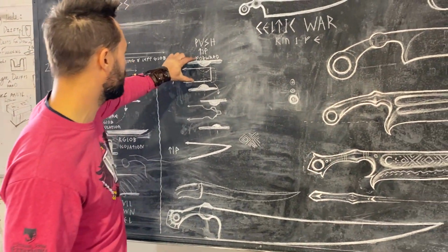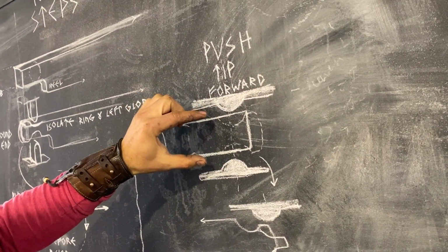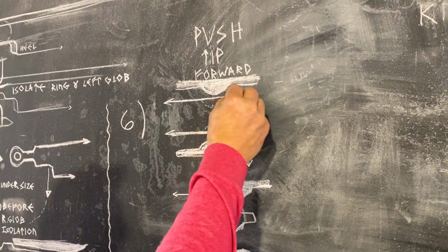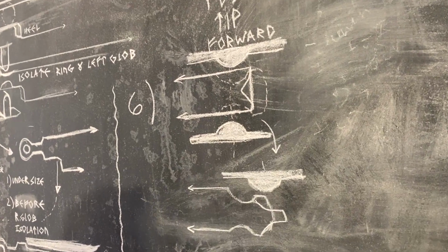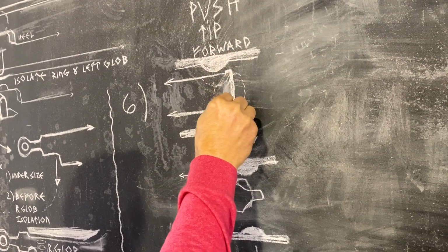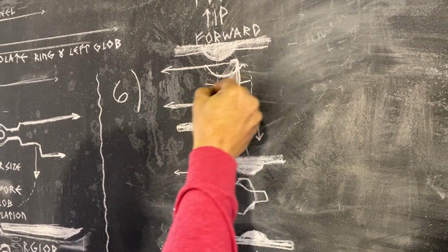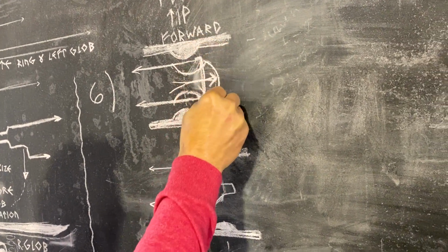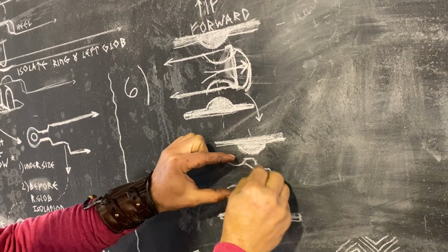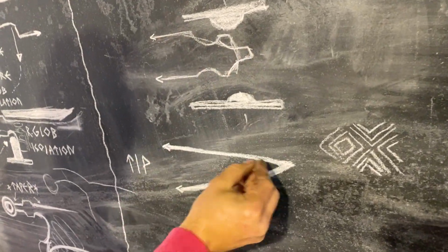Same here. And then over here on the tip, this is sort of standard stuff. Most people are going to know this. A lot of beginners, though, miss this point of forging tips out, and they'll start forging right at the tip. If you move this die to the tip and do that, it gives you this shape, and now you've got a crack right in the middle of your piece. However, if you start just back from the tip, leave just a little square here, a little square there, it's going to push like this, and in the center it causes the metal to move out and creates a mushroom effect on the end of that bar. Then you can squish right on that mushroom and push it right down to there. And from there, it's really easy to hammer that out to a perfect tip.